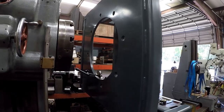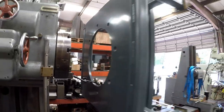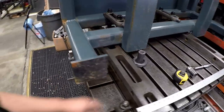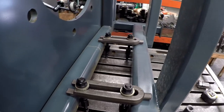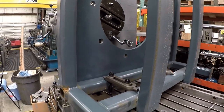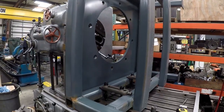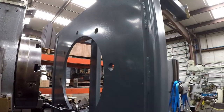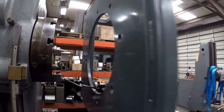I've got her set up in the boring mill. I found the center and I'm going to bore this thing out — hopefully. I don't know how rigid it is. This is my setup: using the big boy parallels that I got from Jack. I've got four studs with some big strap clamps holding it down, and it is a really rigid setup with the half-inch wall tubing I used to build it. I'm about to get the boring bar set up and see how it reacts to cutting. I don't have to take big cuts, but I need to take about a quarter inch out of that hole. I already found the center.